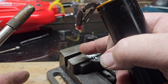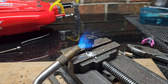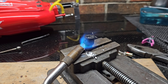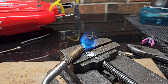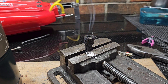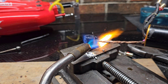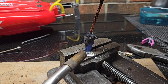I've got a ratchet extension with a little hole inside and I put a screw in the side to plug up the hole — we're going to get this solder stupid hot. You want to get it hotter than you think you need it, because you want to melt any remaining insulation off the wire. Get it really hot. I've got some flux on my wire here, and I'm going to get the wire hot and dip it in this solder.